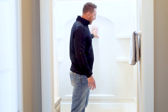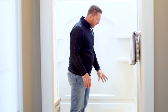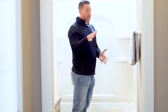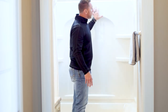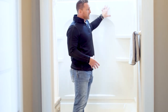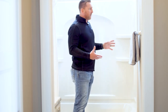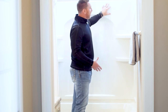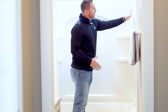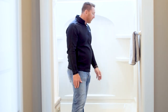Going back to the unit itself, it has a non-abrasive, non-skid surface on the floor of the tub. You never want to wax or polish that, because it can become slippery and actually a hazard. However, if you wanted to get rid of some of the hard water mineral deposits that may accumulate on the shower walls themselves, you could use a non-abrasive product like a car wax and apply that on the unit just like you would your vehicle — not with a buffer but by hand — and you can actually wax the side walls of the shower and restore that luster or new-look finish.